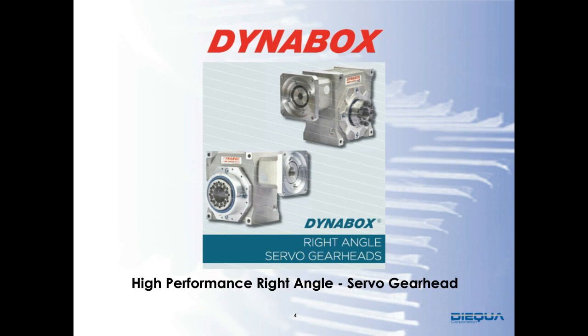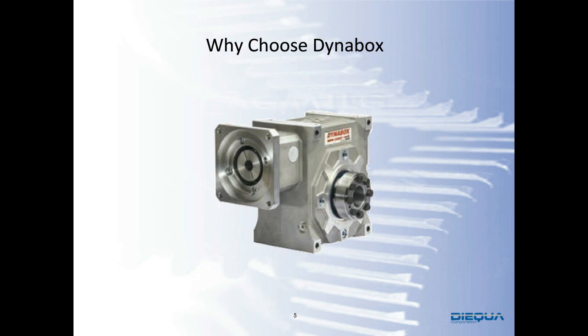And we'll be touching base on that for the next 30 or 40 minutes to go through where this product really excels in application, performance, and capability. So when we take a look at the Dynabox product, why choose a worm-based solution? Well, uniquely, you have ratios from 5:1 through 90:1 in a single stage, and in a very compact housing design, sizes ranging from a size 25 through size 110. And what that references is the center line of the input to the center line of the output, so that you have gearboxes that span in size from roughly a 1-inch to about a 4-inch separation, giving you a pretty broad range of both reductions and torque capacities.